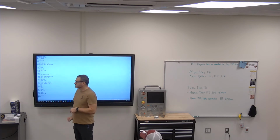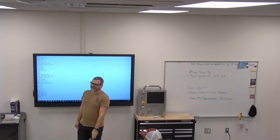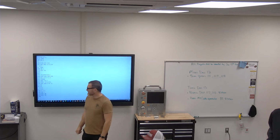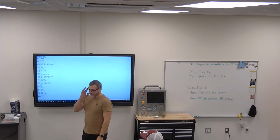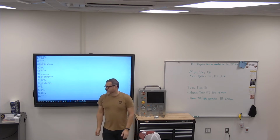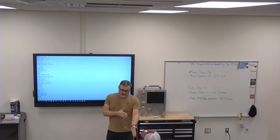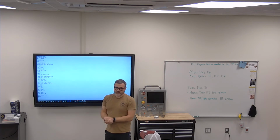What does M30 do? Does it start the spindle up again? No, M30 does not. It's program rewind. It goes back to the beginning of the program.